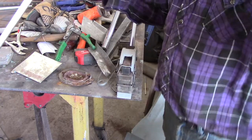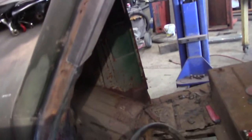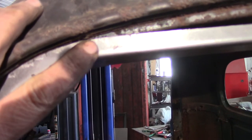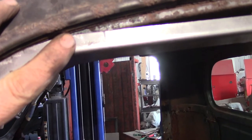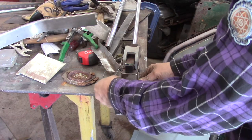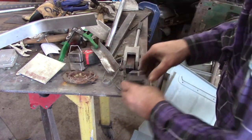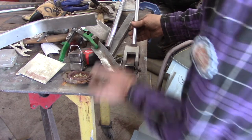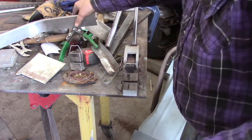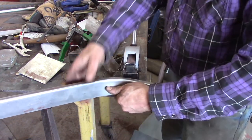Getting closer. So I went a little too far. So far I've got this fitting up pretty good, but right here I'm gonna have to shrink it now to bring it back. I'll put a mark there so I don't lose my place — right here it says 'stretcher' right on there. So I'm going to take this off, pull it out, and put the other die in. Tighten up the screws. This is going to shrink this back a little bit — hopefully just right.